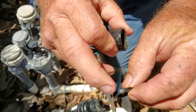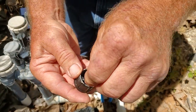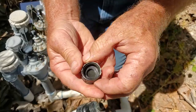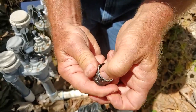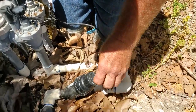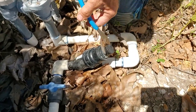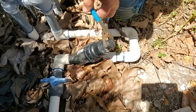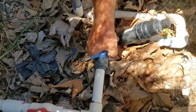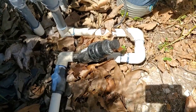These tabs go on the high side of the threads — they help hold that washer in place. You just have to make sure those tabs are all down as far as they can go so that it's all flush. We're only going to make this snug. We're not going to crank it down tight because that can cause something to crack. So that's good right there. Now let's see if that solved the problem. No leak. No leaky. Good to go. Okay, on to the next thing.